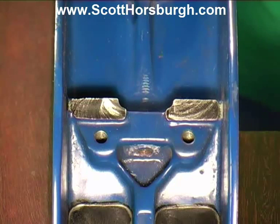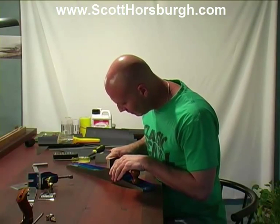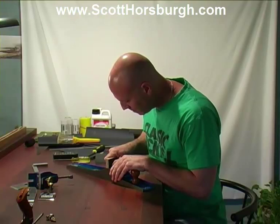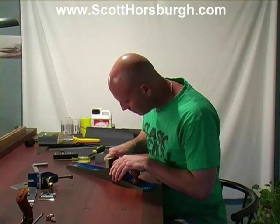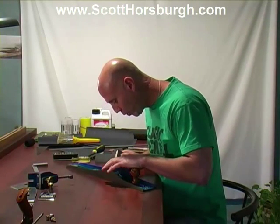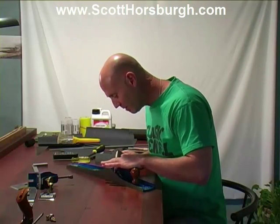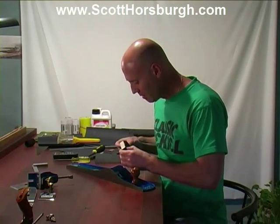After that 15 seconds worth of rubbing with the sandpaper, the 240 grit, you are able to see the polished high surfaces. It's very apparent there where it's high and where it's low. There's not a great deal to remove, and I don't think it's going to take very long. Feel the balance, feel the level. If you run your fingers over them, you will be able to feel the ridges. Just going to move that along to some fresh paper.